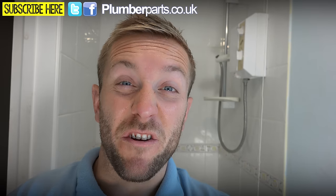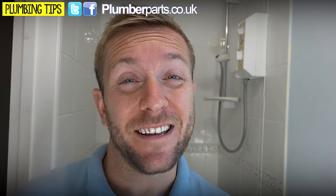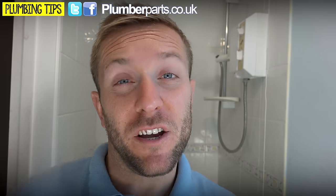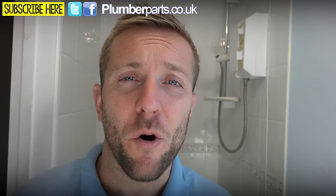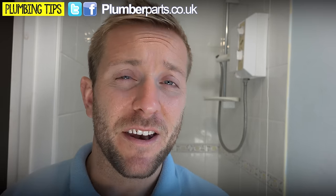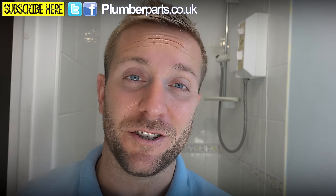The next thing I want to do is actually turn off the water supply. All these showers should be fed from the mains system, okay? So it's going to be fed from the mains water supply that comes into the house. You're usually going to find that underneath the kitchen sink or somewhere, hopefully not a place where a plumber has put it, that's in a really hard, difficult to find place. So the next thing is to turn the water off. If you can't do that, then you can't carry on with this job.